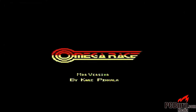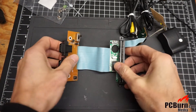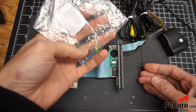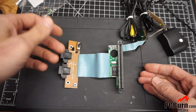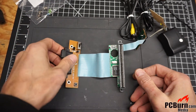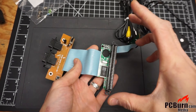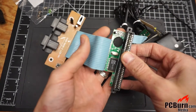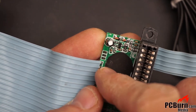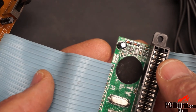And there we have it — that's what you get. This system has been horrible, but I am going to take it apart and see if there's anything else we can do with it. There are a couple of points I'm still curious about. I want to add an LED in line with the power just to show when it's powered up — it's about 4.5 volts over the switch, so I can add an inline LED with a resistor. I might actually build a slim line case for it to hold everything in. Also, there are some unpopulated pads on the board, and I'm going to put switches on those to see exactly what they do. I think one of them might be an NTSC/PAL switch, but I'm not sure what the other two are — it would be neat to see what they do.